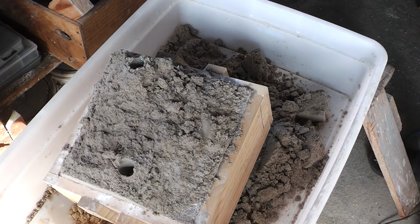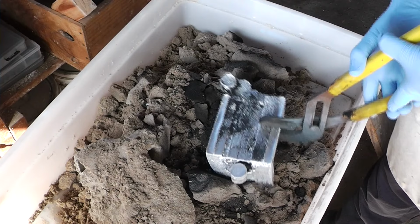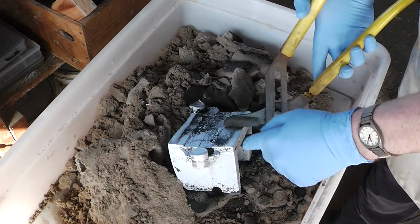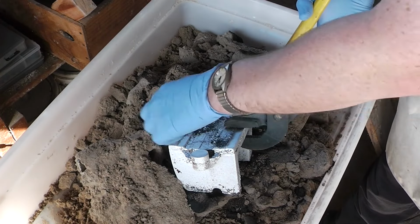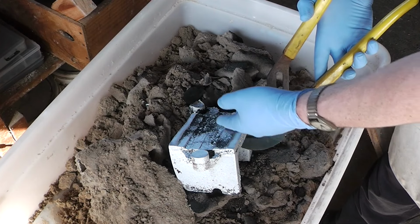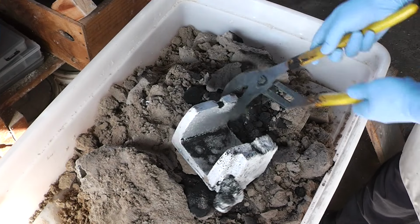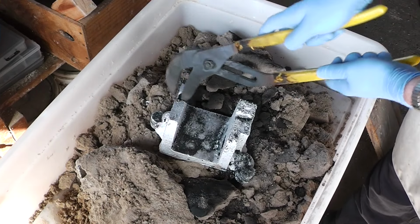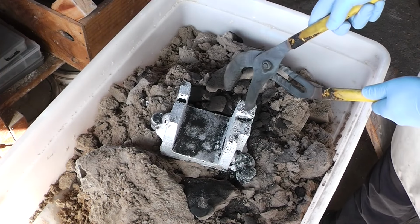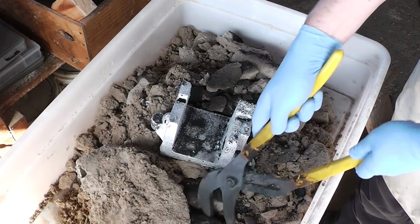It ended up being a short pour, so I'm not optimistic. Yep, you can see here these sides didn't cast properly. They should be quite a bit above the wear pads there. Also on top, the thin side cast properly, the thick side did not. What a pisser.